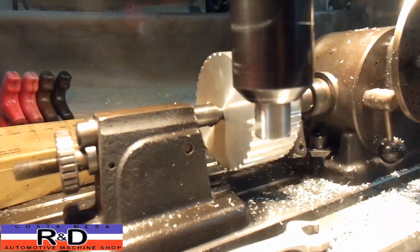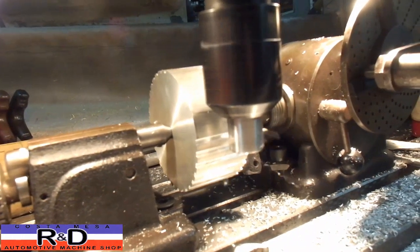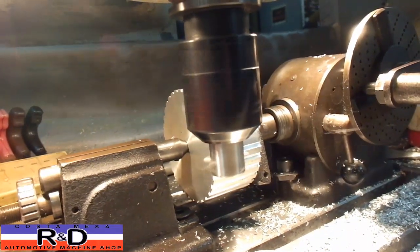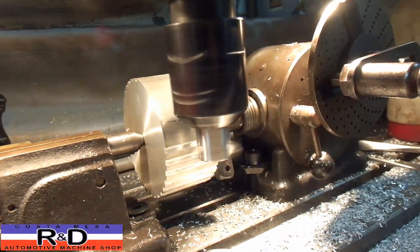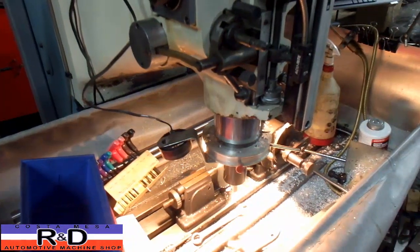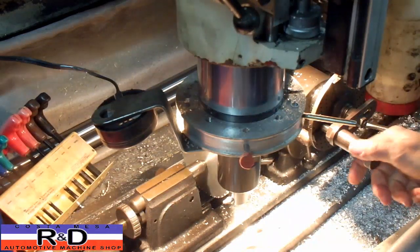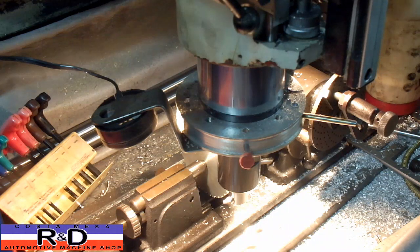And start! You may be wondering why we've got such a wide gear on this — well, we're actually going to make two out of this one piece, so that's kind of why we have it so wide. Guys, you've got to remember to move the sector arms. If you don't, you get a real rude surprise at the end.